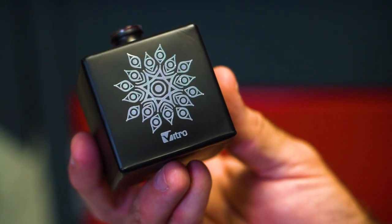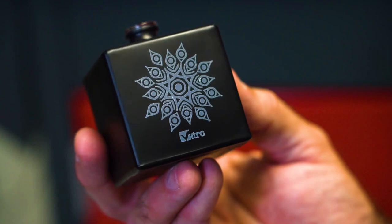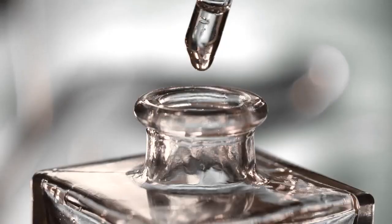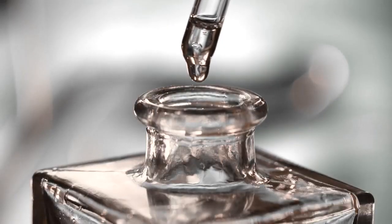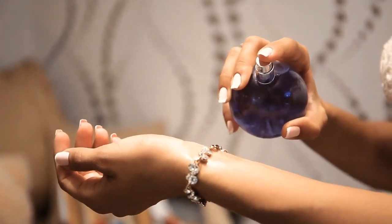This is a perfume bottle, and if you think about what does this have to do from an ink perspective, obviously you can't rub off, but even more importantly it has to be resistant to the chemicals that go inside, which is primarily alcohol, which is what forms the basis of many perfumes. So the ink in this specific case has to be very resistant to alcohol.